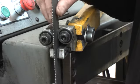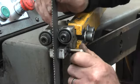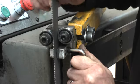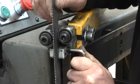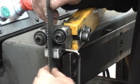So all you have to do is replace those guides. Then there's a pinch screw here which you can do up until the blade is just a reasonable transitional fit in there — not so that it's snagging in any way, but so there is absolutely no rock in the blade.